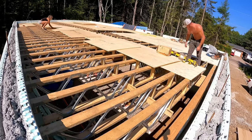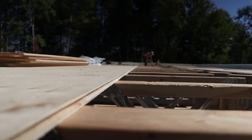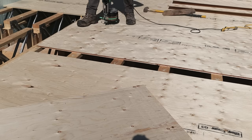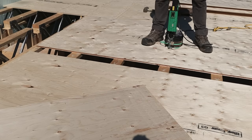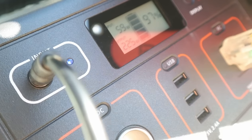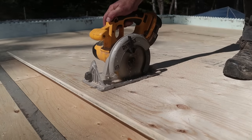Next up is installing the subfloor. First Brandon went along and shimmed and leveled out all the floor joists. We used 5/8ths tongue-and-groove plywood. We PL'd each one down to every floor joist to avoid any squeaking in the future, and then screwed them all down really well. The generator died last night and we had this plug-in screw gun to save time, which works really good — except when the generator dies on you. But we found a solution: that little Jackery will run it. That Jackery has seriously come in handy. So I'm going to work on PL'ing the joists and putting the sheets down. We're going to try and get that rental gun back for 2 o'clock today and it's already almost 11:30, so we've got some work to do.